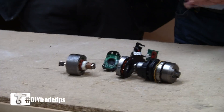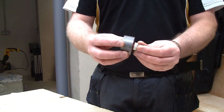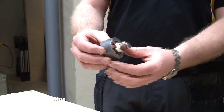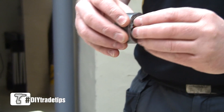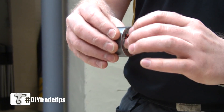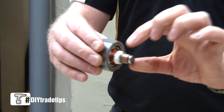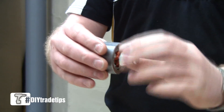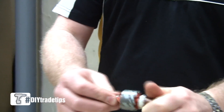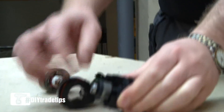Tell us a bit about the technical details behind this brushless technology. Well, if we look firstly at the conventional brushed cordless motor that we use, you can see that the permanent magnets are on the outside and the windings are in the middle. To make the windings in the middle magnetic as well, to make the motor spin, you need to pass an electrical current through it via carbon brushes on this armature here. You can see the size of that is quite big and quite heavy compared to the brushless one.